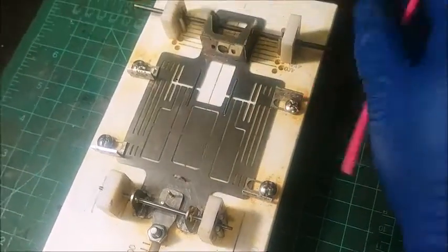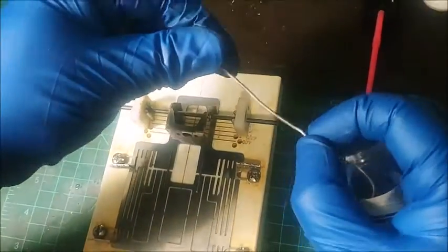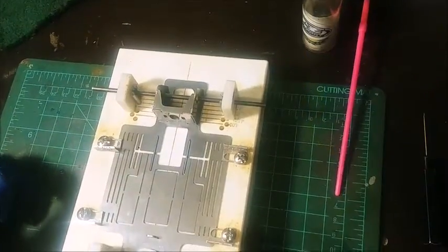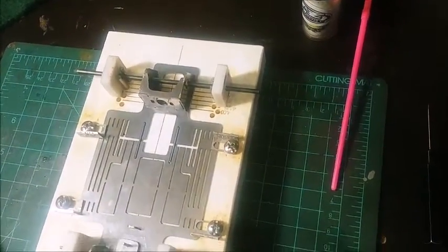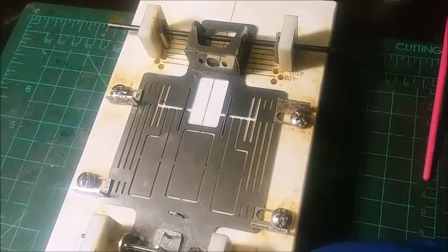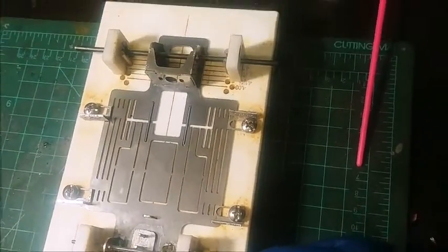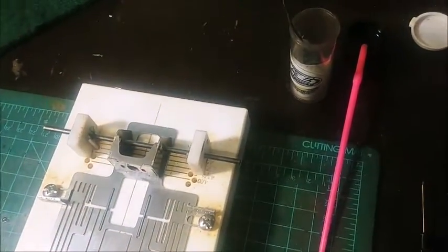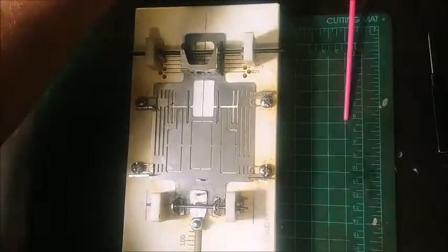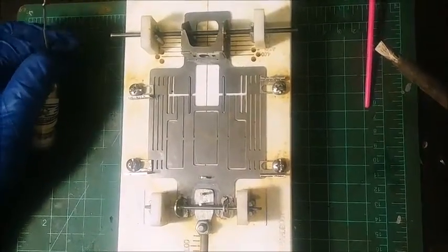So that's that. As far as solder, I like a little bit thicker solder. On a lot of the Eurosport stuff I used to use silver solder only, silver bearing solder. I actually have found with this particular chassis, being that it's thicker metal and the heat transfer that you need, I like working with just regular 60-40 solder. We just kind of lay it on there real nice, make sure your joints are good, and the 60-40 solder does a pretty decent job. Now, I'm not the best builder in the world, but I think I'm going to be able to talk you through how I do things.